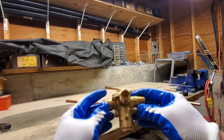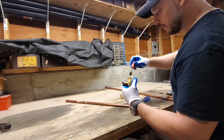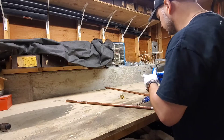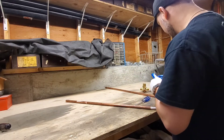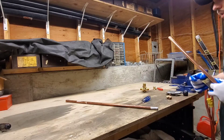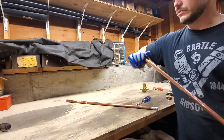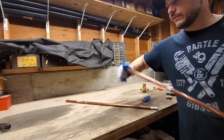With our body, it says 'up' — make sure that you install it right side up. We'll take our half-inch fitting brush and just clean it quickly. The brass is brand new so you don't really need to clean it all that much. Our wingback 90 is for the shower head. I already cut this to size. The height of your shower head and the height of your cartridge is purely subjective to the homeowner — whatever they want. As a rule of thumb, the cartridge is about 40 inches, or three and a half feet, off the ground.